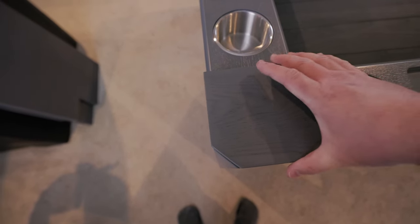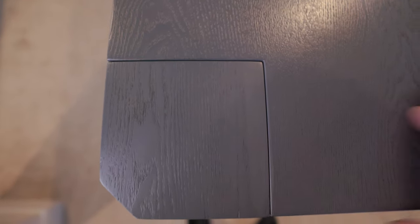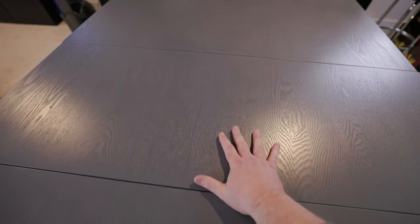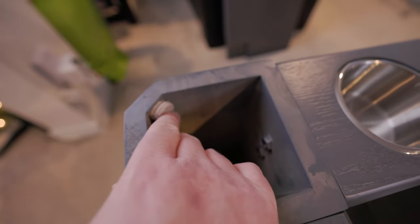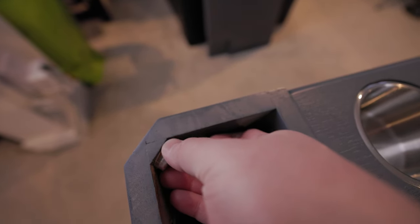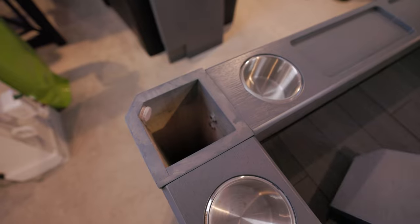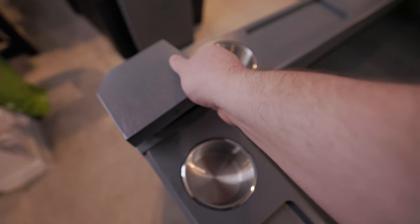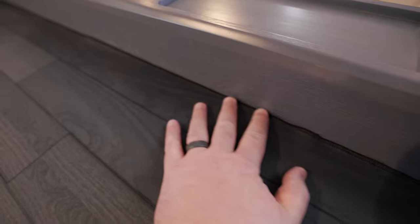So the next issue was the wobbliness of these caps. I don't know why there's so much play in here — maybe it's to make the top easier to get on and off. What I ended up doing was putting a couple of felt furniture pads in each one of them, just to make it a little bit tighter. Because with all that play, it's easy to separate the top panels and you can get these gaps, and they just move around way too much for my liking. Most people may be fine with this — these are just the little furniture pads that you can buy at a hardware store. I doubled them up just to make them thick enough to get as much play out of it as I could but also be able to put it in easily. So you can see here — a lot less play. When the top's on there, it's much tighter.